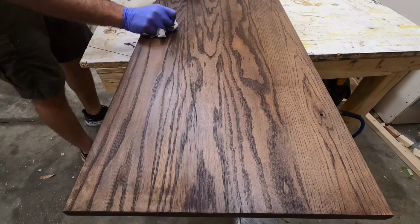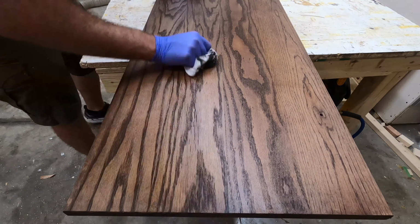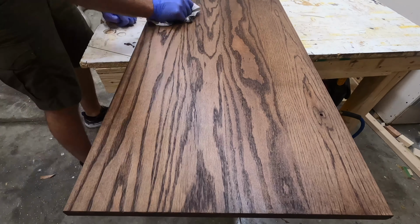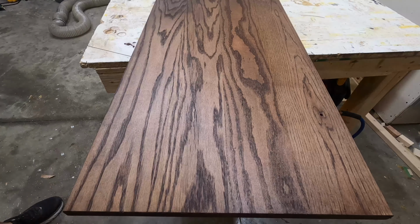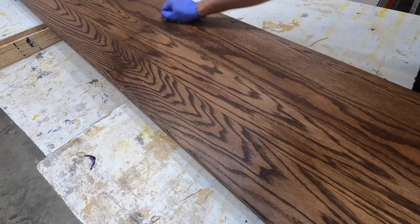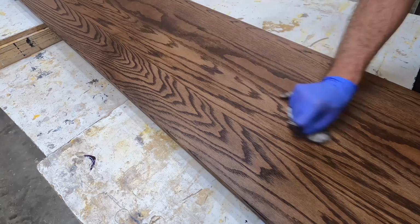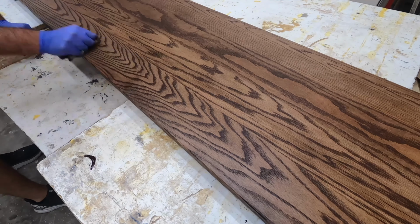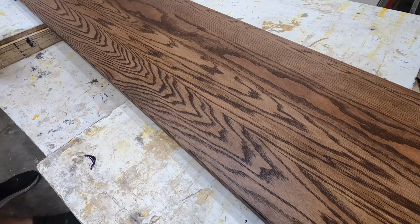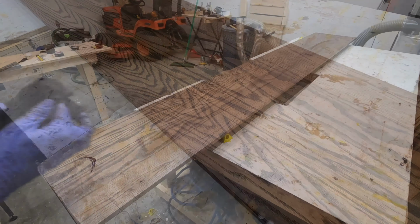So if you watch my channel and you've seen a lot of my previous videos, you'll notice that whenever I'm staining something with a stain that isn't Rubio, you'll hear me often say to go in the direction of the grain in case you leave any hard marks, because those are impossible to get out with a different stain. With Rubio, I still try to go with the grain, but it really doesn't make a difference if you have those hard spots because they are possible to wipe out, as you can see here.